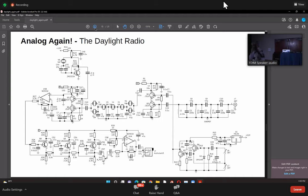So it's fairly simple, if you see, right? It's hardly about 11 transistors and one IC. Yet it's got performance which is actually better than some far more complex and complicated receivers. It's almost contest grade, except that I have not put AGC into it because I just wanted to keep things very simple. And frankly speaking, I didn't have time. I started building it on this Saturday and I finished it on Sunday. Okay, so 2 days. Well, I'm lying, because I've been thinking about this. For example, the cascode mixer, I experimented with it almost a year ago.